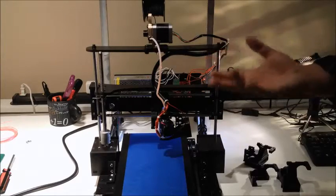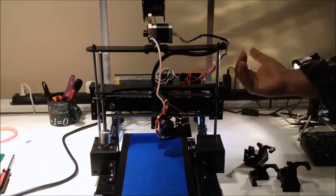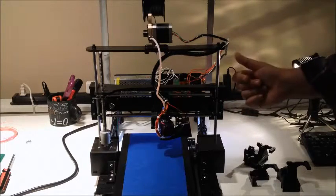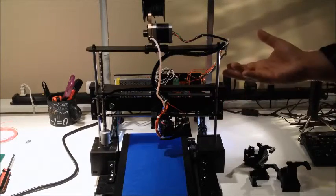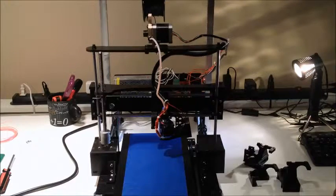As it's printing, if you think about it, the Z-axis only moves upward - it's not like a CNC router which goes up and down repeatedly. So having upward pulling tension will work for a smoother upward pull. That's sort of what the contemporary pulley designs achieve.